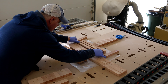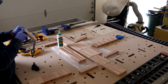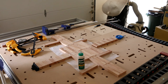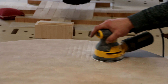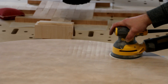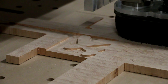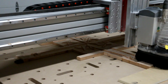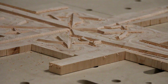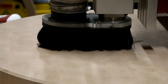Here I'm laying out the blank for the final glue-up, which I'll simply do in place on the table. While that was drying I sanded the countertop to try and remove the tool marks — you could barely feel those tool marks with your hand and they took hours and hours to remove with 40 grit. I did the inlay first: starting with getting it flat and then carving that male reverse image. Being end grain, the cuts did leave quite a bit of cleanup for me. Then there was that point of no return — carving the actual countertop.